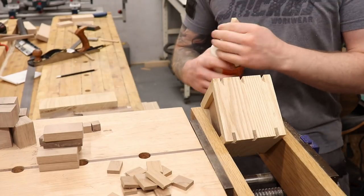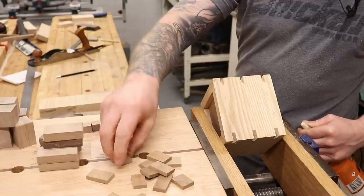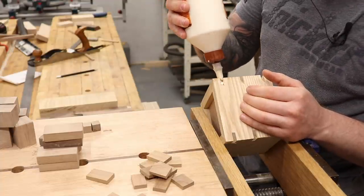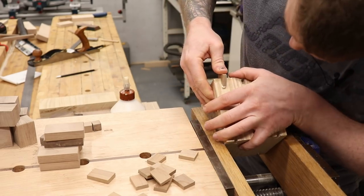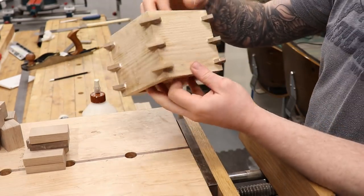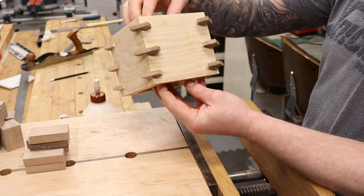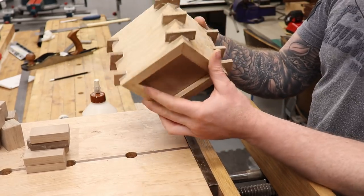All our splines are cut — as simple as that. A quick trip to the mitre saw to cut up the spline pieces themselves, then they just get glued in place. Get some glue in there, make sure they're seated home. Get them all glued in, make sure they're all seated — check each side that they're bedded properly with no gaps, so when you flush them off you're not looking at any gaps. Now let the glue set up, flush them off, sand it up, and then we can cut the lid off.